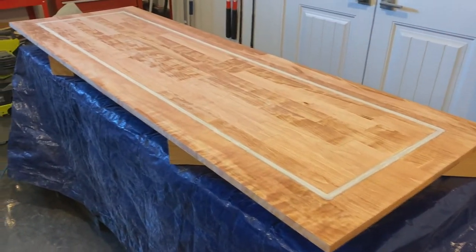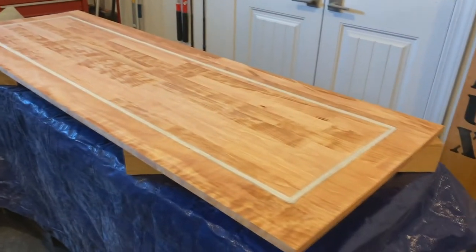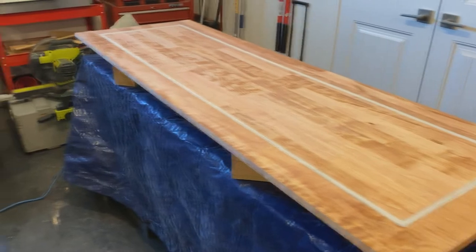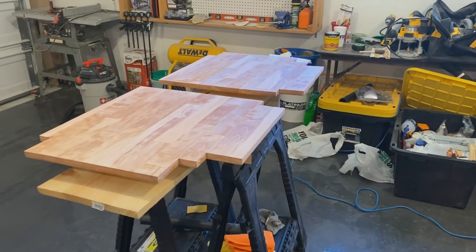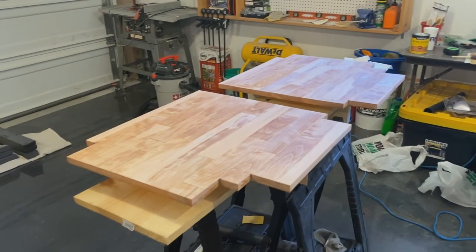There's some special techniques I use. So before I start, I go through with a microfiber cloth just one more time and get any dust that might have settled over the last few days off the tabletops. That works pretty well. And then I'll add my first coat of polyurethane. You don't do it too thickly, but not too thin either.